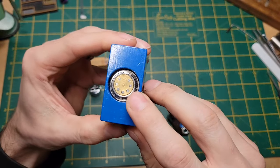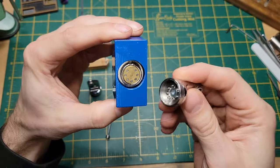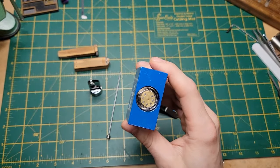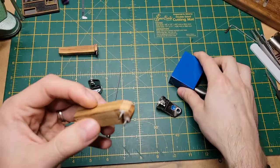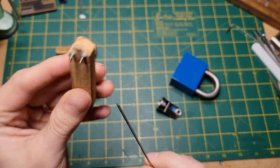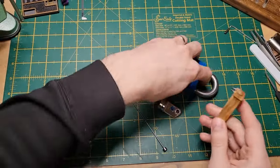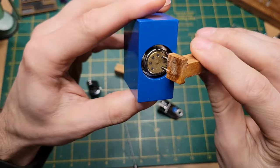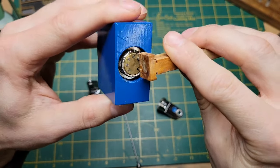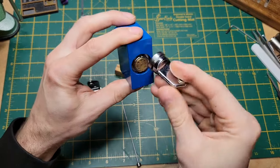There's a difficulty in trying to tension this. There's nowhere to really tension because it's the pins itself, the key, that tensions it. So I had to make a couple tensioners, and I used some ejector pin basically, and I made a 7 mil gap in these ugly blocks of olive wood, but these 7 mil gaps will tension every other pin, so I can tension in between the pins, and that's how I tension. It takes 2 turns. It's a 90 degree turn basically to open the lock.